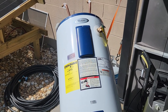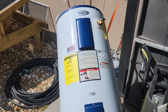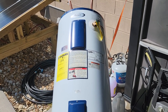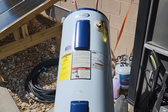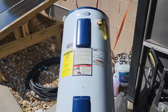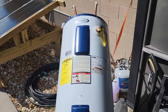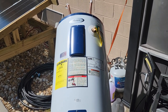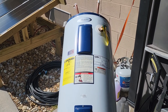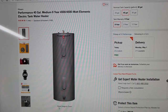When I went to replace this unit with the new Rheem unit, I looked at the efficiency ratings. The old unit had a uniform energy factor of 0.92 and the new Rheem unit had an energy factor of 0.93 — just a hair more efficient than this 10-year-old Whirlpool. The Rheem manual said you didn't need to install a water heater blanket, that it was already efficient enough. I wanted to test that and follow up, because I'd been using a blanket for 10 years and they always worked.